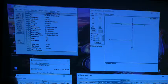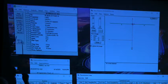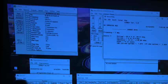Where's the transmission line, sir? All right, now what length have you got? Because I can't see it here. 0.1 foot. All right, what we're showing is the antenna impedance, because we've got the transmission line shortened up to 1 inch. What does it read, Jim? What's your impedance? 77.7. All right, it's close enough to what we've got. We've got a 50 ohm piece of coax feed and a 77 ohm antenna.